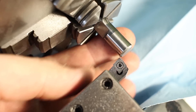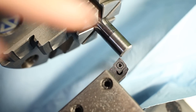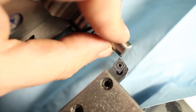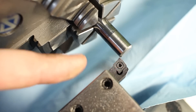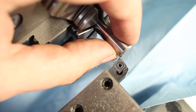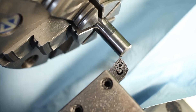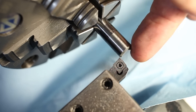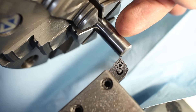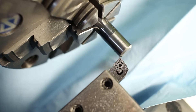Okay, first cut. Finish doesn't look too shabby. The cut sounds really nice. It's really impressive. Let's go down to 9.8mm. Now I will just go down in 0.1mm diameter increments until I see that the insert is not taking a cut anymore. Then I'll multiply the number of cuts by the length of cut — this is 13mm — to get an idea of how long this insert lasts.